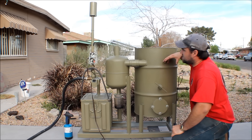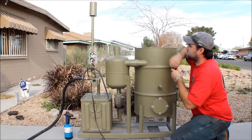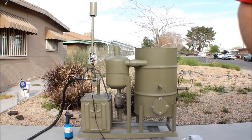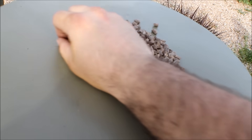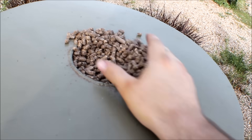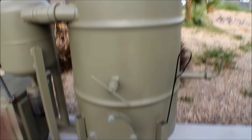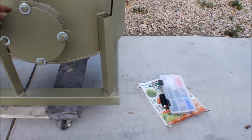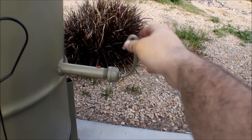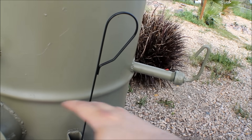Now the only oxygen coming into the system is through the tube that the fuel is in. This main unit is a 30 gallon barrel, and it has a four inch tube welded into the top that goes down about 16 or 18 inches into this unit. This front piece is just a clean out port — it's got a gasket around it. And then this is a shaker assembly. This handle goes through this tube and interlocks to the basket so you can shake it and loosen up any charcoal and get rid of the old stuff before you light it with new fuel.